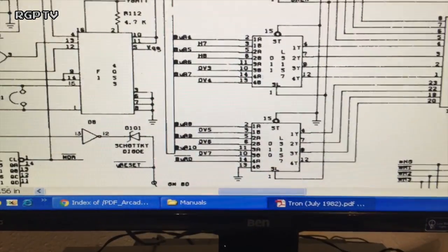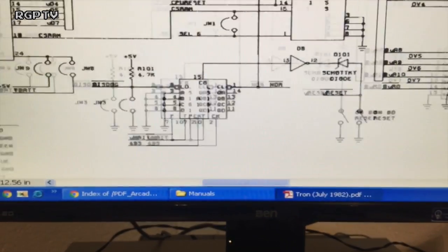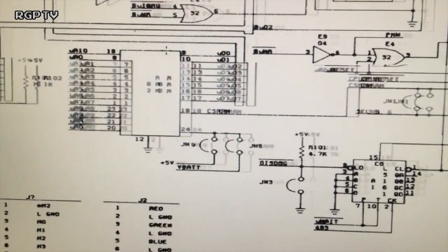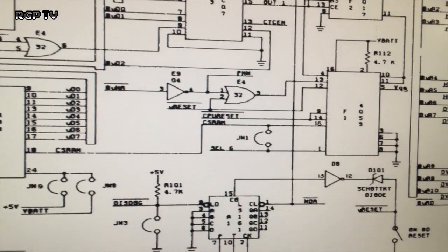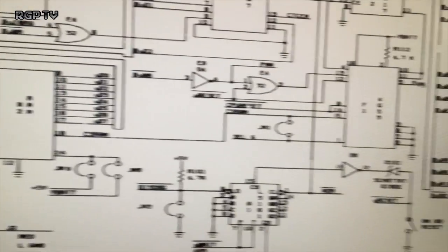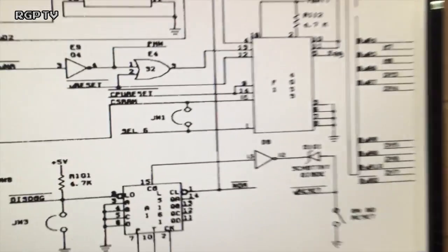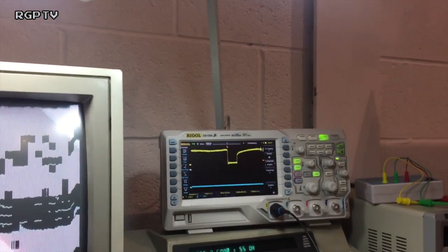Micro reset, F1. Is that B2? Yeah, B2 RAM. B2 RAM, yeah, comes off. Aha, sorry, pin 14. Oh no, definitely pin 15. Pin 15 should be CS RAM on F1. So if I'm definitely looking at F1, the 4055 chip, F1 here, this one is F1, definitely, pin 15 on F1 is definitely cycling low. If I go here and press the stop key,